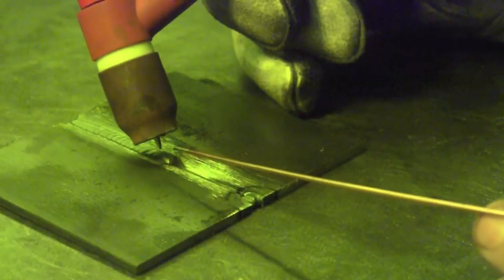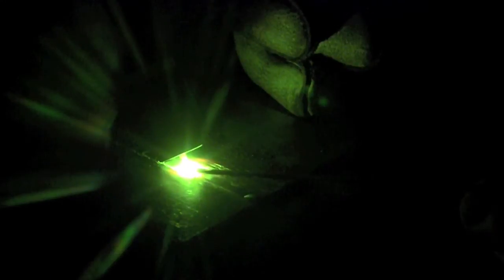It gives us a really nice ripple pattern. As you can see right here I have to re-establish heat in the material because I'm starting over again. With this re-established heat I get back into a rhythm, just letting it pulsate and adding filler material as we go.